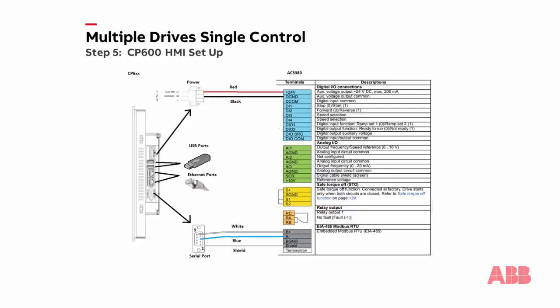The plan here is to load the drive faceplate application onto the USB flash drive, followed by loading it to the HMI. You can see from the graphic where one can plug the drive into the HMI. Once the HMI powers up, one will be able to load the faceplate app onto the HMI from the flash drive.